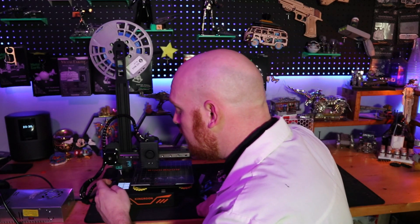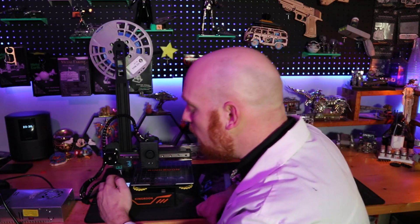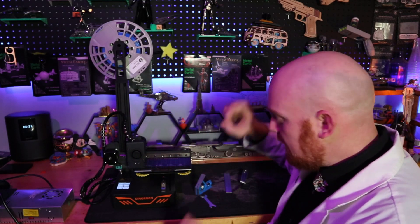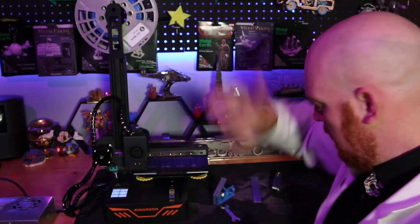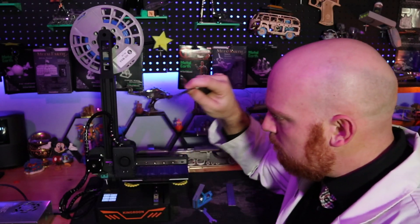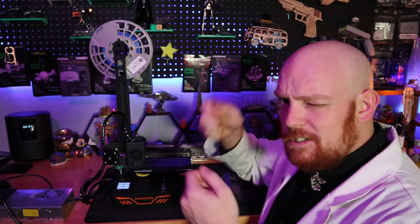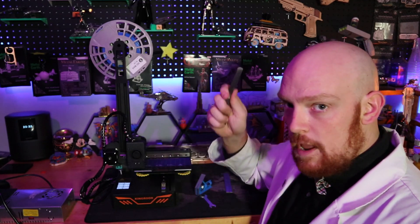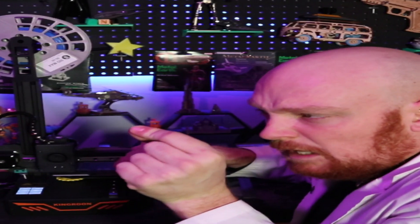At the main menu, we go to leveling, and then we go to 0.1. She's moving — and she stopped. She stopped because she's now officially at 0.1. We're going to take that feeler gauge and put this little piece of metal between the nozzle and the bed. This particular gauge I'm using today is measuring at 0.0015 or 0.04 millimeters. Let's see if it goes between the needle and the bed — and it does. We're not just looking for it to go between the needle and the bed; we want there to be just a little bit of friction, just a little tiny bit of pull.